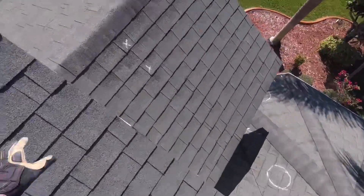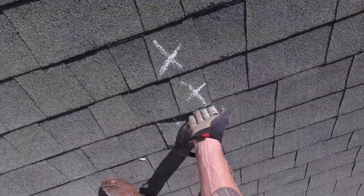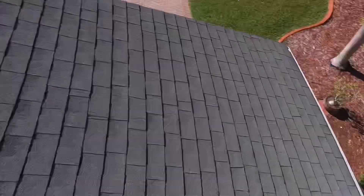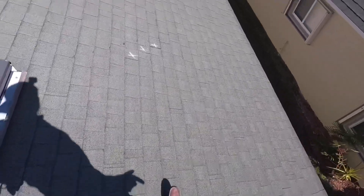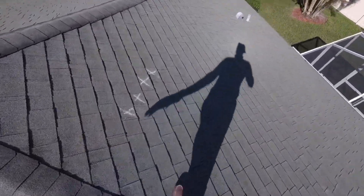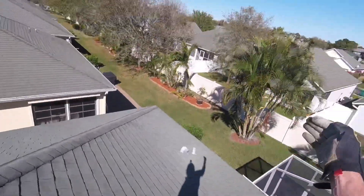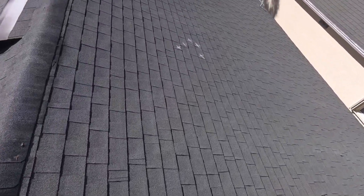It's kind of a big roof, so got to move fast. Here's more of the same — this side of the roof seems to have more damage. Look at these poor guys, just barely hanging on. Looks like you had some patchwork done there, and there's another soft spot right through here, so again we're going to replace that wood. Here's more lift up — I checked all sides of the roof. A little more scarring, lift up. We're going to replace all the gooseneck style vents and reboot all the bathroom vents. I checked this side too — this is usually the storm side, coming off the ocean. You can pretty much check anywhere on the roof and find the same conclusion.